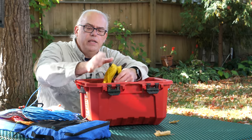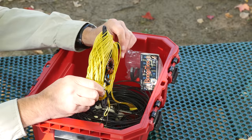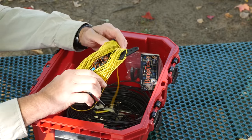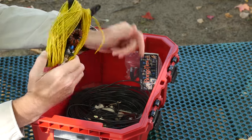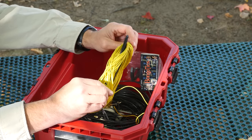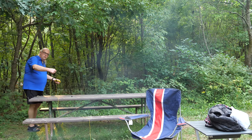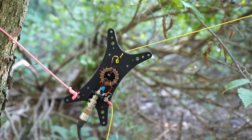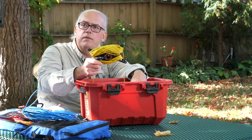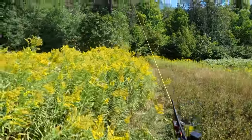My next antenna — I usually like to keep a wire antenna and a vertical antenna. My second wire antenna is the Coffee and Ham Radio's Apollo antenna. We did a review on this not too long ago and I like it a lot. Of all my EFHW half-wave antennas I've used in recent history, this is definitely my favorite so far. It comes as a kit and it's not difficult to put together. Once you get it set up and adjusted, the dips fall right in place. I've got this one tuned resonant at the bottom of 40, 20, 15, and 10 meters, with enough bandwidth to use it without a tuner.